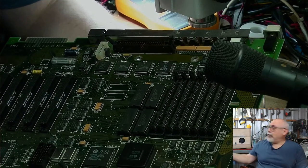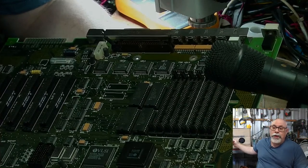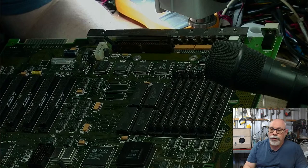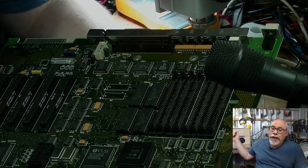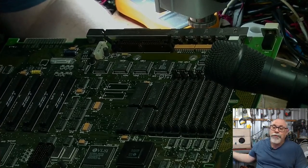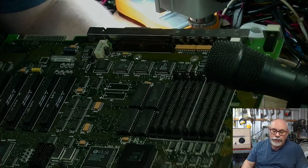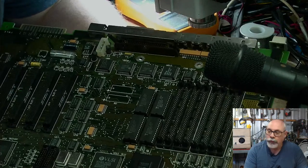One thing I can tell you is it's very important, in terms of the prep of the surface, for sticking the transducers onto the bottom of the tub. Because I prepped the surfaces in a way that I thought would be great, and it unfortunately wasn't. It wasn't enough stick. And some of the transducers fell off, and I didn't see them fall off, and they ran for a while not attached. And if you run the transducers not attached to the tub for long enough, you fry the power supply. So just letting you know, you can learn from my mistakes, but that's the whole purpose of doing a video like that.